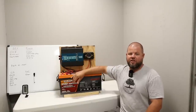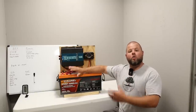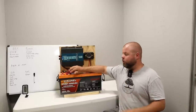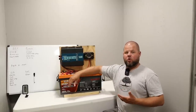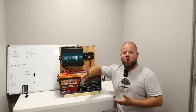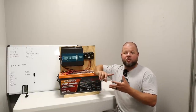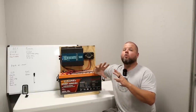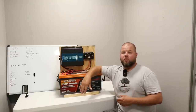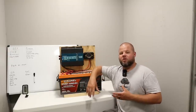As far as output wattage, 1500 watts in my example — I was building this for an upcoming room where I'll probably use less than half that. You always want to go a little bigger so you have a buffer; it's better to spend the money up front than change your inverter out down the road. 1500 watts would easily run a freezer and refrigerator, window units, medical equipment like CPAPs, fans, phones, and TVs. That 3000-watt surge can really handle the buffer of compressors starting up. That's what the majority of people are going to build a DIY system for.